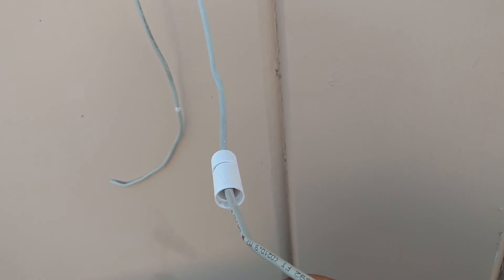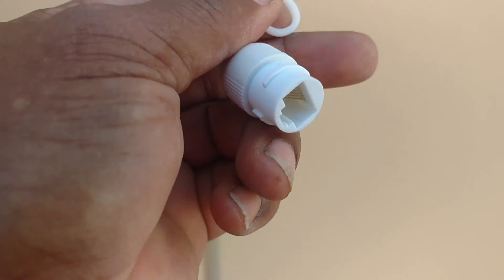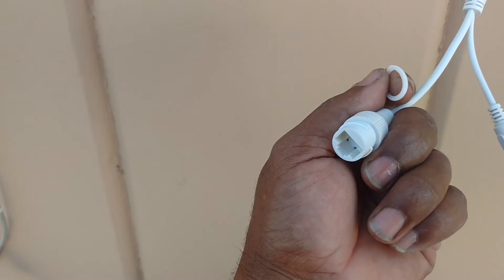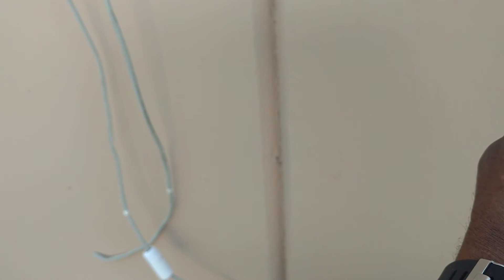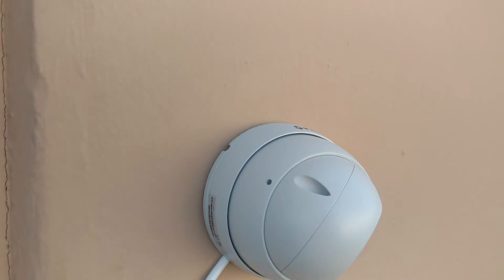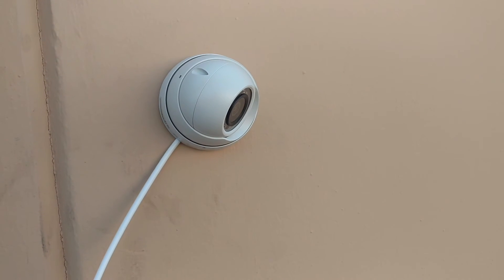I'm going to go ahead now and get the camera on the wall and put the rest of this connector together and fire the camera up. I'm going to take this seal, put it over this connector, slide that stuff down the connector, plug it in, and twist lock it on — and I should have a weatherproof seal. I'm going to go do the next camera, then check and make sure they're both on and properly aligned. Then I'll put in the set screws to lock the cameras in place.